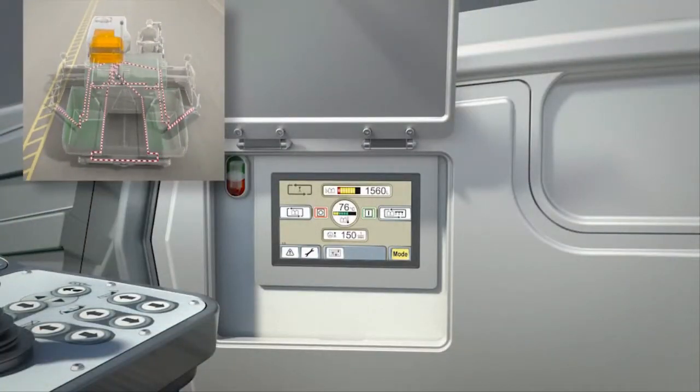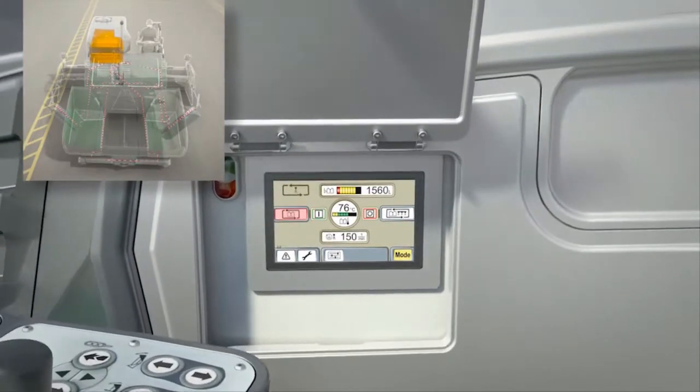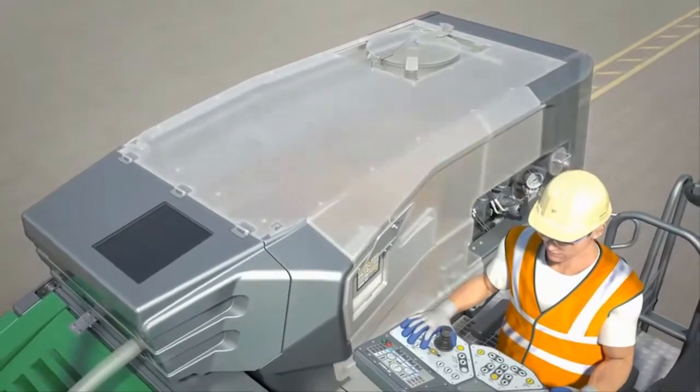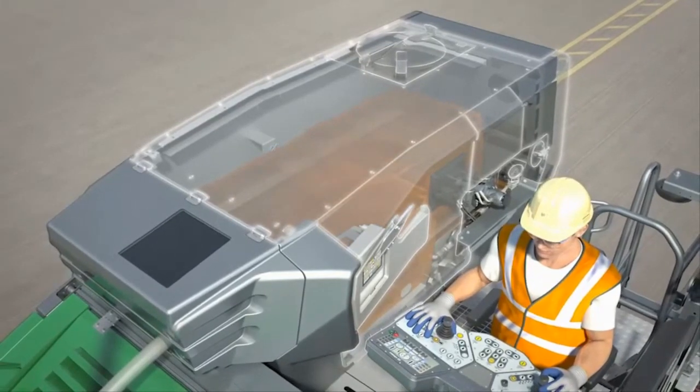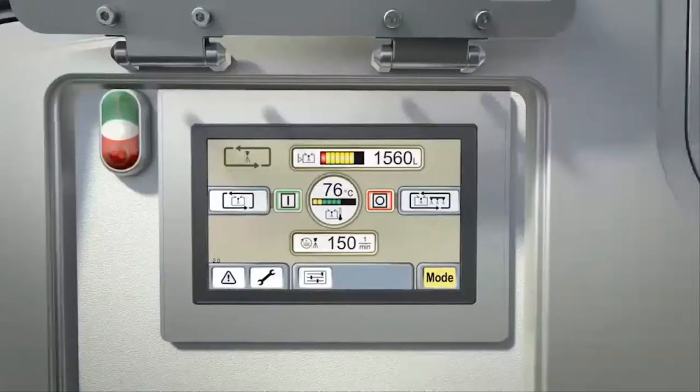During extended breaks in work, it is better to move the emulsion through a smaller circuit. In this case, it is simply circulated inside the tank without pressure. In comparison to the large circuit, this prevents unnecessary loss of heat by the emulsion and saves precious energy.